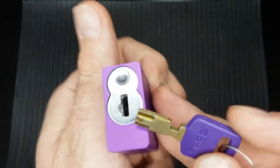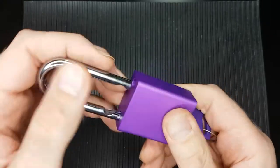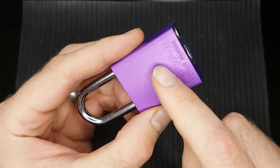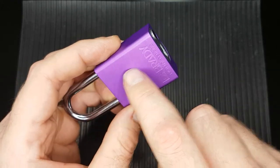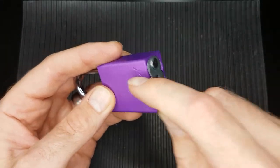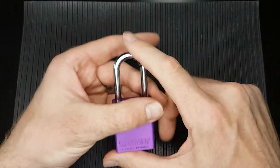These are the ones with a funny looking key and an odd sort of keyway. There are six pins - sorry, not pins, they're sliders. Rather than a pin tumbler mechanism, these are sprung sliders. You've got a spring on one end and the slider on the other end, so we just need to push down those sliders to hopefully get this open.